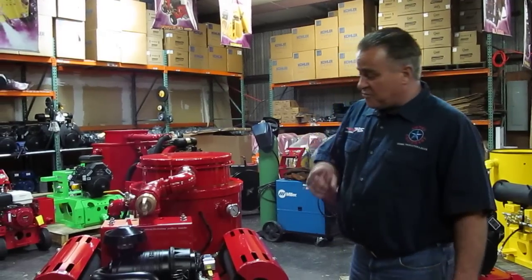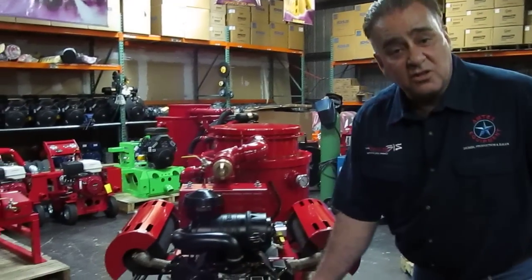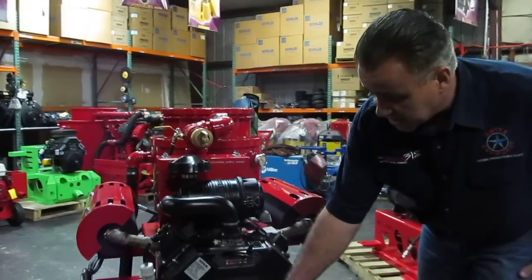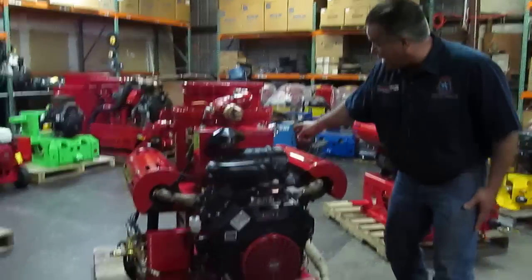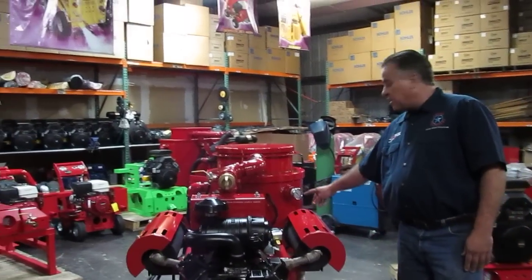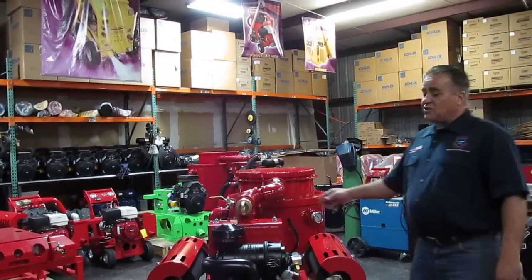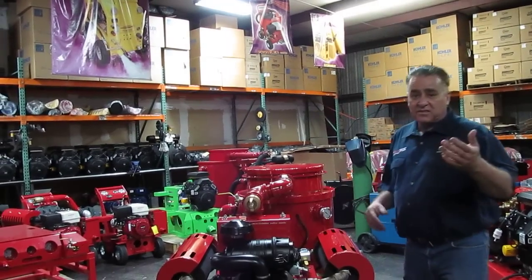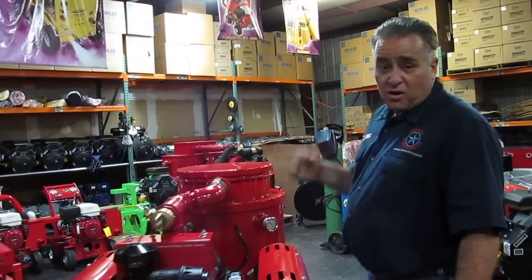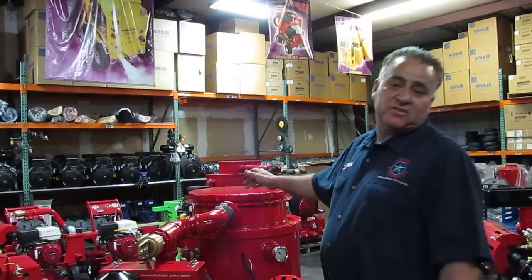However, if you turn the machine on and get, let's say, 20 inches of mercury on the front vacuum gauge, but as you look up you only get about 10 inches of mercury on the tank, there could be two cases. Either you have a loose gasket with some kind of air leakage, which might happen once in a blue moon, or in a lot of cases, your filter needs to be cleaned.